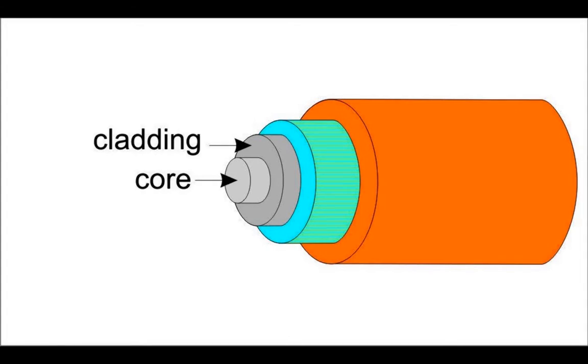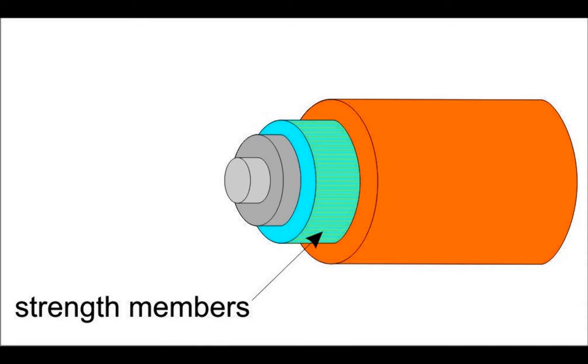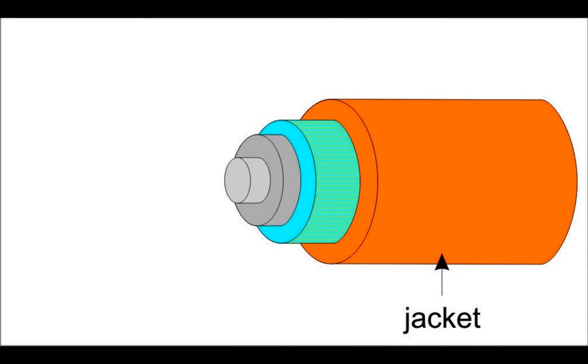This diagram illustrates that there is no reason why patch panel connector ports have to match test equipment connector ports. The key thing for technicians to understand is that patch cables all have the same basic internal construction, which includes the optical fiber, buffer, protective aramid yarn, and outer protective materials. Aside from fiber type and core size, the only thing that differentiates one patch cable from another are the connector styles on the ends of the cables. Take these single-mode patch cables, for example — they're all the same, except for the different connector configurations.